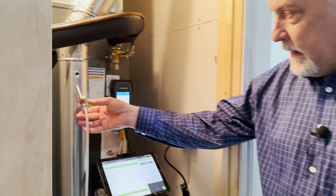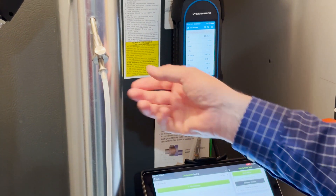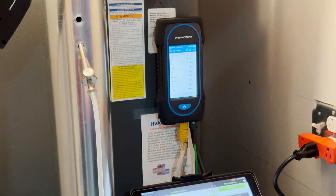These are a lot lower cost of ownership because of the long sensor life, and the initial cost is lower also, and they are very reasonable to service. I've got the probes hooked up the same way, with an accessory thermocouple for ambient air temperature, plus the draft gauge. What's nice is I can measure draft and combustion at the same time. A lot of times when we're doing testing, draft is dynamic — you'll see it start falling off. Maybe you have a blocked chimney or an undersized stack, which will affect combustion, but unless we're real-time measuring draft, we just don't see it. That's what this NCI version of the kit offers.